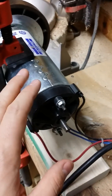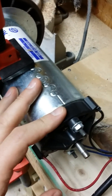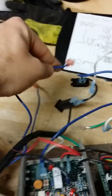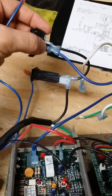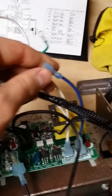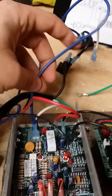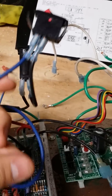One of these blue lines is connected to the motor. From what I've figured out and read, these two lines deal with some type of thermal protective breaker inside the motor. They've been disconnected — one of them used to go directly to this switch. I disconnected it; this blue line used to be attached to this component. I just swapped wires around so I didn't have to do any crimping or use any tools.